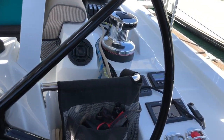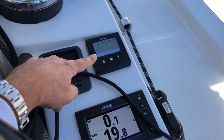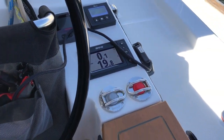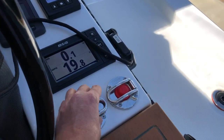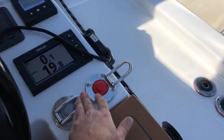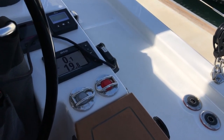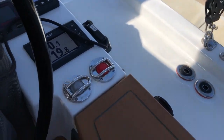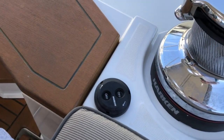And then just outboard, we have another Yanmar display, chain counter for your electric windlass, and H5000 display, which is also on both sides. And then for the electric winch controls on this side, we decided in San Diego to add two buttons from Antal so that you can open this up and stand outboard and use your foot to press the electric winch button to get better visibility of the mainsail if you choose. But these larger buttons are a nice upgrade from the smaller Harken two-speed buttons.